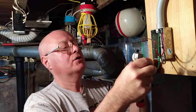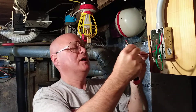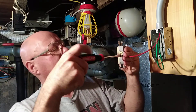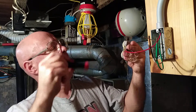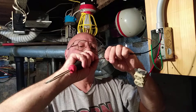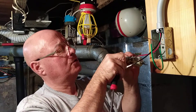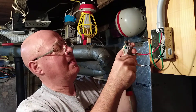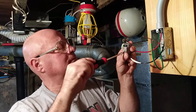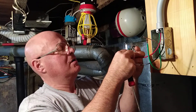We're going to hook this outlet up. The red is our live wire, so I'm going to twist these strands together and put it around the brass screw. See how those strands all stay nice and together? Now for the neutral wire — twist the strands together. We marked this black wire neutral, so we're going to put the wire around the screw like this. That bit of insulation will keep those strands together.